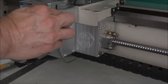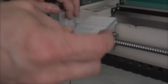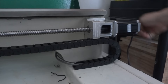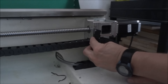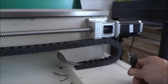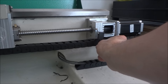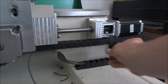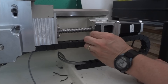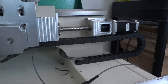That'll give me way more travel on the X than I need, so I think that'll be good. I'm just going to machine this piece of scrap down and bore some holes in it so it'll fit the Z-axis. It's pretty straightforward — I'll probably mount it right here and it can just hit up against this. Next we'll work on getting some brackets, and we'll come back and take a look at that.